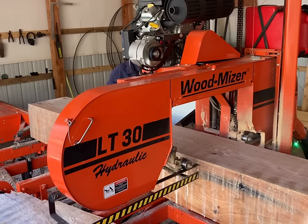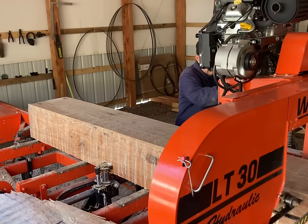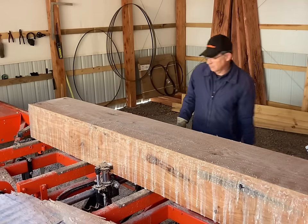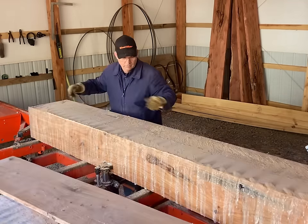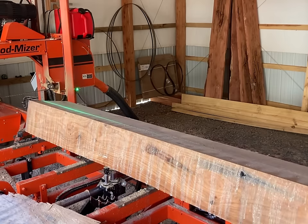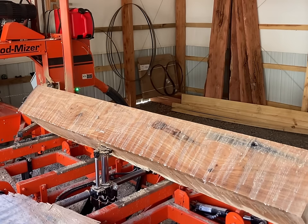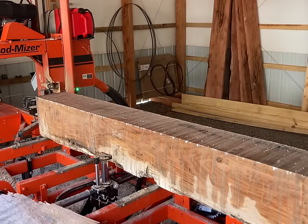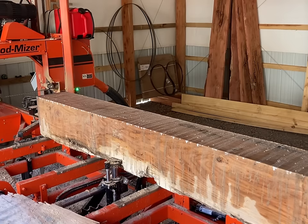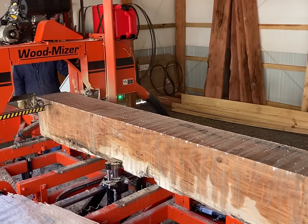The side of the log we're cutting on now isn't too bad — it's got a few small knots in it. The biggest problem is we're perpendicular to that stress crack. Stress in the log causes it to crack after it's cut, and once we cut a board with that crack in it, when it dries it's going to continue to crack that board open — it can rip the board long ways too. So I decided to go back to the face we were cutting on, even though it's got the blue stain and a fair-sized knot, and cut a few boards off and get down to the juvenile wood and quit on that side completely.